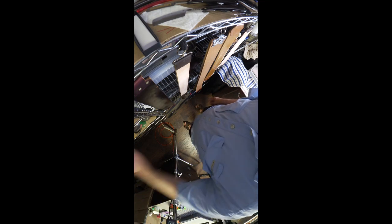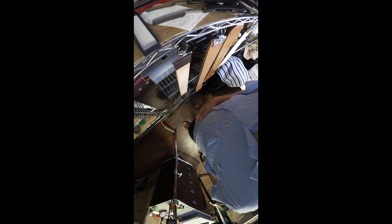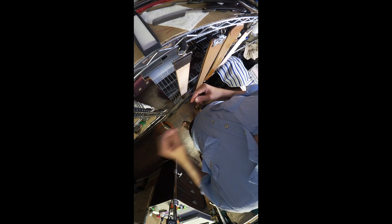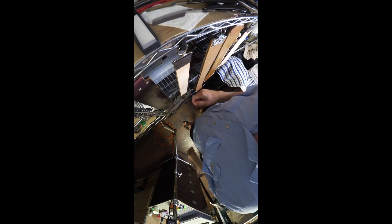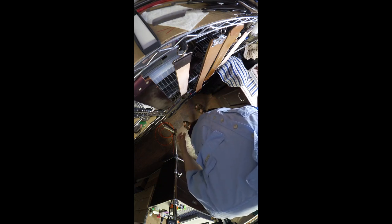That is not to say that they don't put concavity on — they certainly do. But the razors can take more without chipping than they do put on currently at the factory, because the labor charge for pushing the razor to the outer limits of its metallurgical abilities doesn't get back to you in terms of selling to the average person. Maybe the super fan will like that, but I don't think the average person buying a straight razor needs it. It helps to have a little bit of concavity, but I think you can do more, so I'm going to concave them quite a bit with that one.